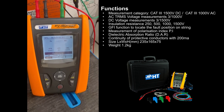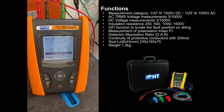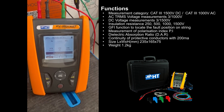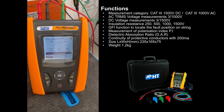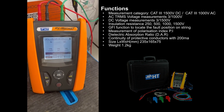While that's working everything out, this tester also has a 1500 volt insulation test on a live supply. It also has a continuity test, which is good for checking that panels are bonded, because if any of the panels are accessible through Velux hatches or windows you can check that the frame of the panels is actually bonded to earth.